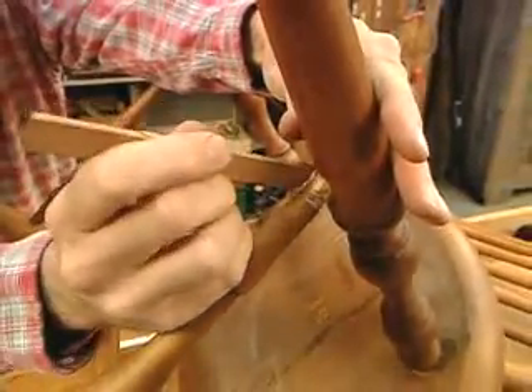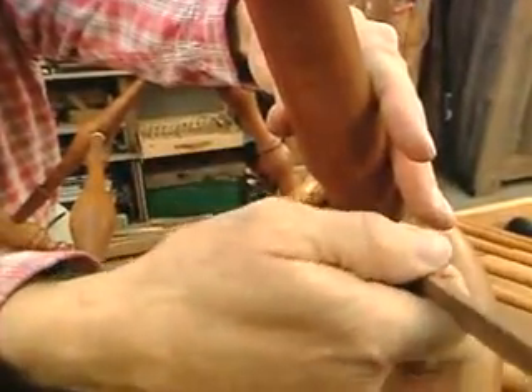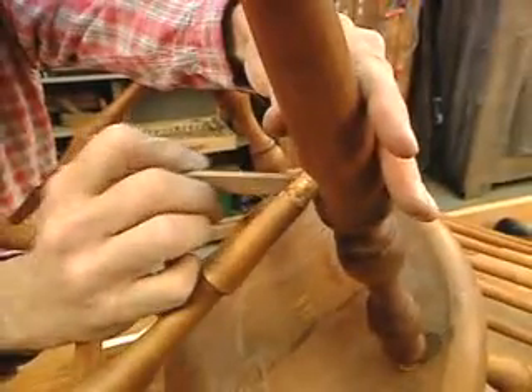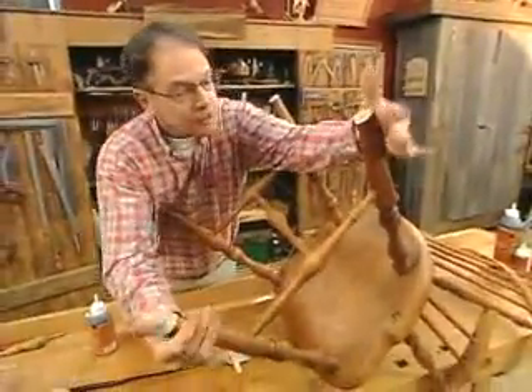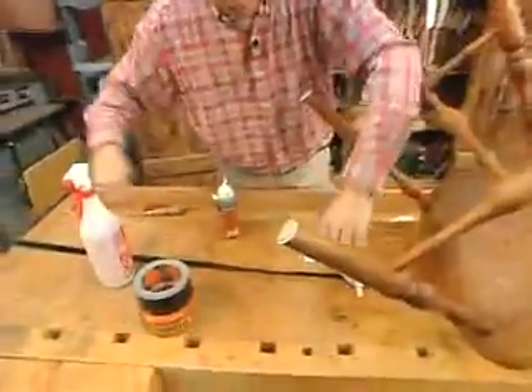What I do is use a piece of scrap wood. You don't need a ton of glue here — you work it out all the way around. Less glue is more in this case. Then what I'll do is mist it with water, then draw it tight. Because the glue actually expands a little bit when it dries, you need to clamp it.